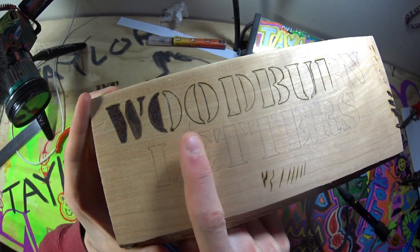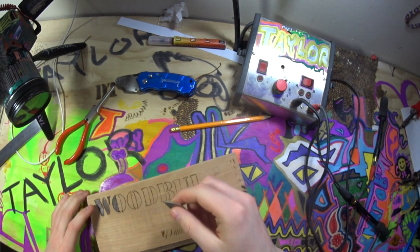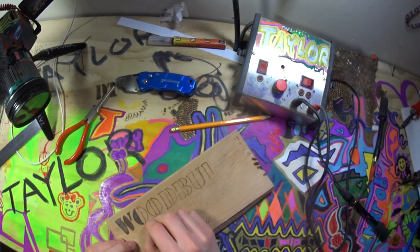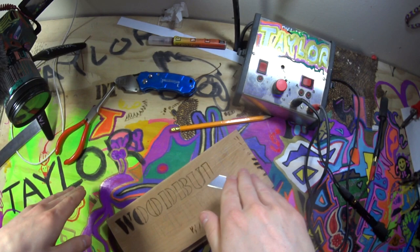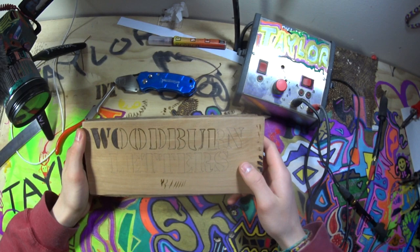So I've just made a mistake there — see how it comes down too far? We don't want that. What you want is a box cutter like this, or just the replacement blades. That's all I use — just the blade. The wood grain goes this direction, so I'm just going to scrape that direction with the tip of the blade, just ever so gently. You can figure out which way works better — forward or backward or both — and just kind of lightly scrape back and forth until that problem is gone. Then also kind of blend that in a little bit by scraping and making a dished-out shape rather than just a line. And there you go — it's pretty well gone.